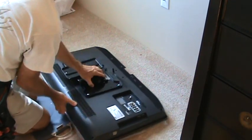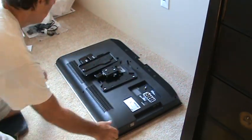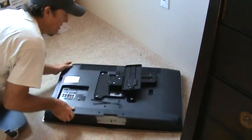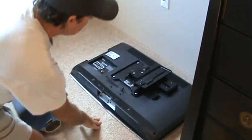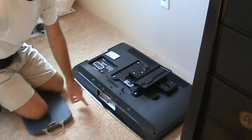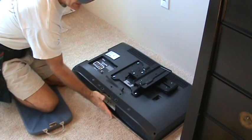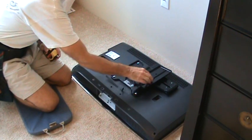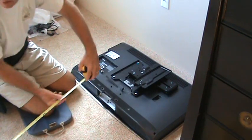And I know that's right — that's the bottom. Remember I wanted five feet two inches to the bottom edge of the TV, so I know this is the bottom. I know this is up tight. So I've got to measure five feet two inches from this edge, then measure up to the bottom of this bracket that's going to be bolted to the wall.